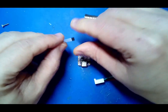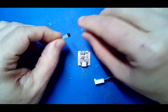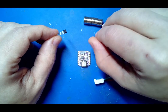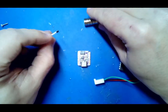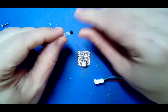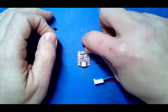Now, there's plenty of other tutorials out there that talk about Hall effect, so I won't go into a great deal of detail about that, except for the fact that the typical Hall effect sensor you see is configured with a setup that is snap on and snap off. So it's either activated or deactivated because they're used for alarm systems like a door alarm system. They're used to monitor rotation of devices, things like that. Those on and off ones will not work as a trigger because we need analog values. We don't need that on and off digital. We need a continuous